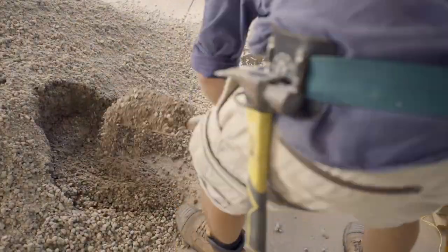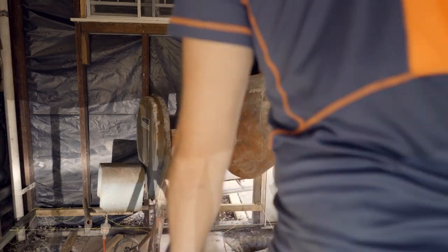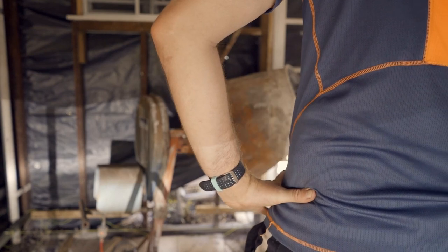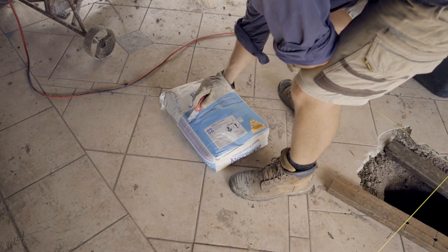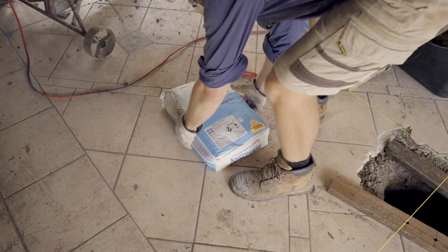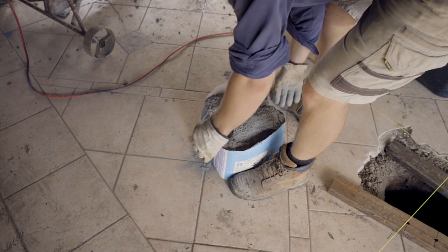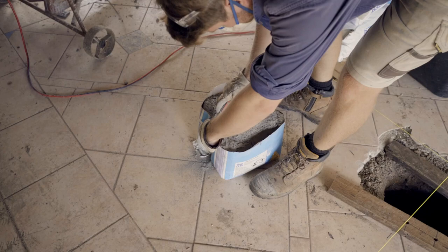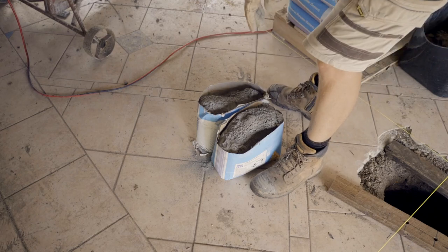Unfortunately we had some pretty tight access so I had to shovel all the concrete in by hand into the back of the room, and Will stood directly in front of the camera — I was trying to show you how I mix up concrete but Will just got in the way. This is how I cut up a concrete bag: I just find it easier to split it into two parts, make a little slice down the middle, lift it up and then give it another slice down the middle to make it into two neat little packages. That way you don't have to shake a bag in front of your face. It's much easier to manage the bags this way.